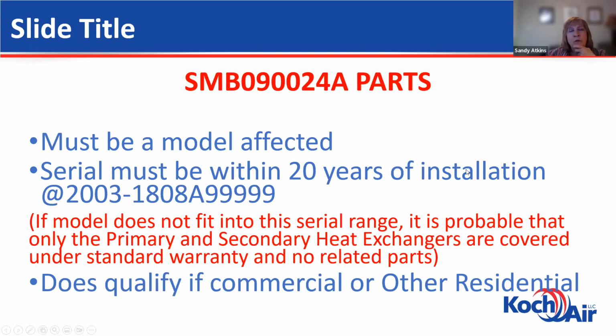So the SMB 090024A is for parts. It must be a model that's affected, which is on the bulletin, and the serial number must be within 20 years of installation. So like I said earlier, when that bulletin first started, the units on there, I think they started with 1992. The bulletin I have right here says the 29th week of 1993 to 1808 onward with your serial. So as these years go on, the range drops off because it has to be within 20 years.